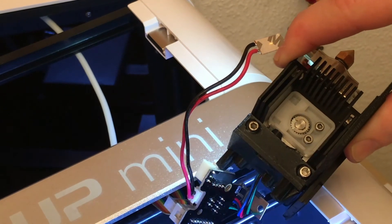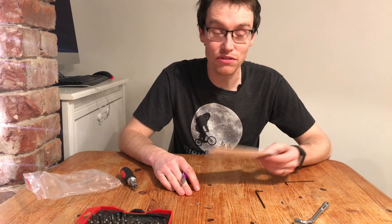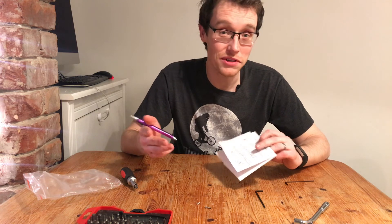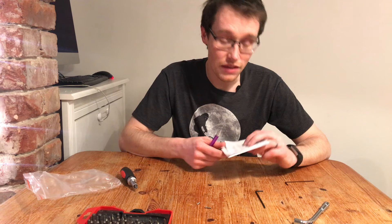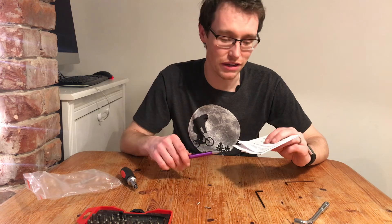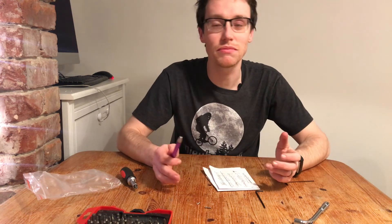Let's change the stepper. Well, I'm having to admit defeat. I've gone through my list: checked the nozzle — no problems. Electronics — everything seems absolutely fine on the stepper motor board side, no problems with wiring, simple board, wave-soldered. Software — I've updated the firmware and gone through all the steps. The stepper motor itself I've actually swapped out, in a great irony, for a RepRap unit — something open and maintainable. Put it on the machine, ran the extrude program — nothing. Checked the driver gear — nothing. So I think it's probably some kind of issue with the main board, or maybe something at a software level that I just can't tell.